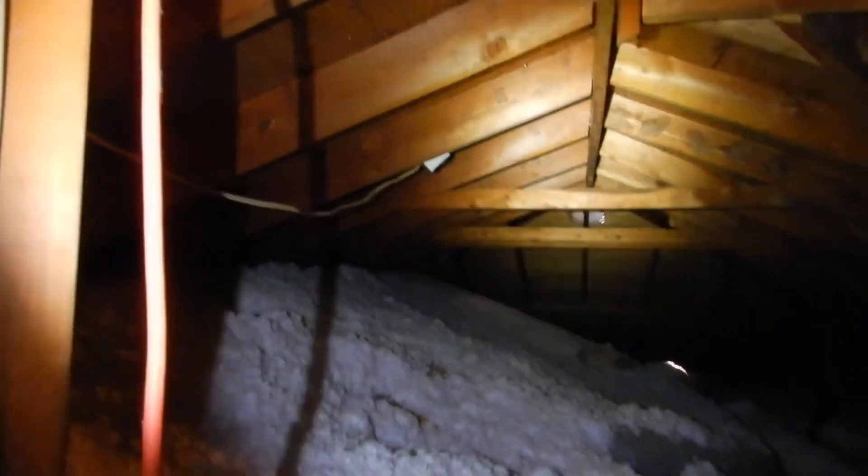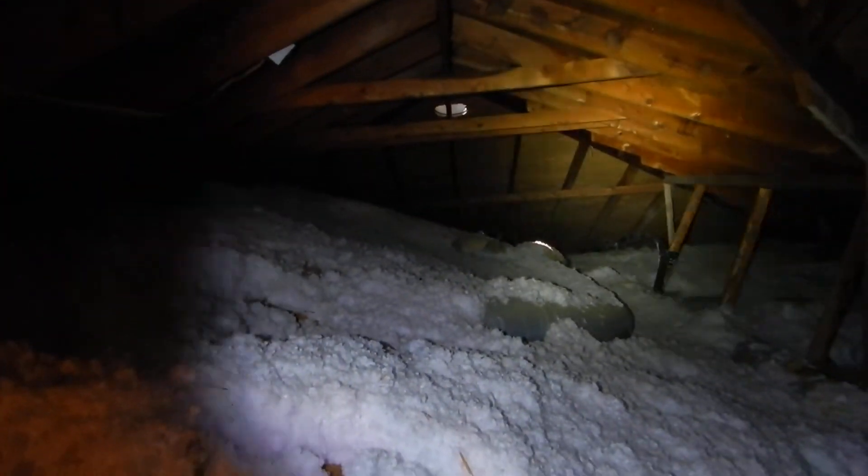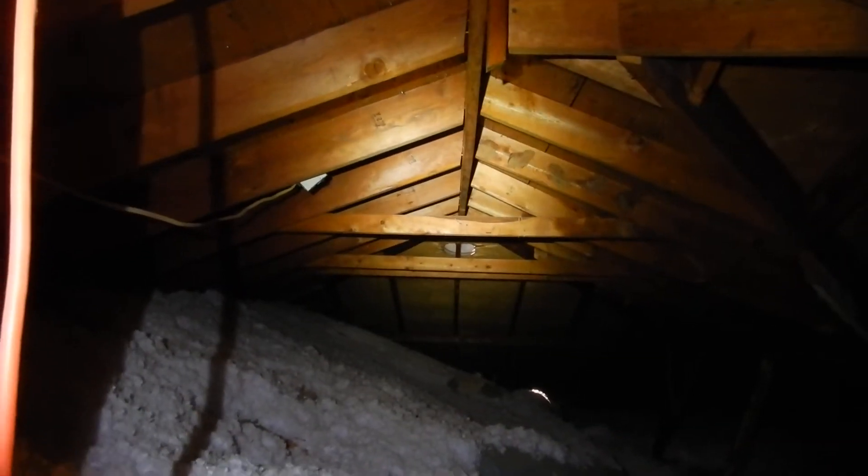So to summarize: we put new insulation on top of old insulation — not technically wrong, but not desirable. We have no depth markers. We've got a little rafter spread. We're missing insulation next to the knee wall in the living area. And our air conditioning duct is compromised. We've also got a rafter with a big knot hole on the stress side.